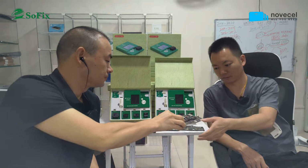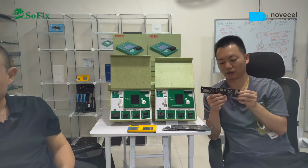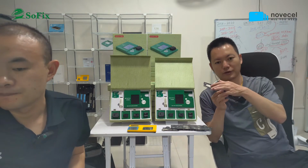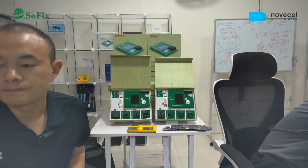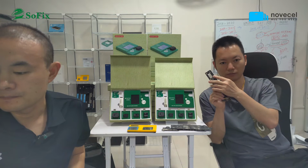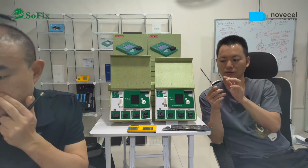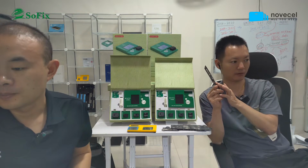So the socket is different from the T2 model. The T2 chip controls the power on socket, the touch bar, and the fingerprint. But in the M1 model, the M1 chip controls the touch bar, the fingerprint, and the power on socket. You can see the RAM, memory, CPU, and GPU are together inside the M1 chip. So on the motherboard, it's just the M1 chip, the PMIC, and the NAND chip.